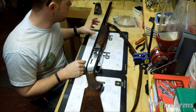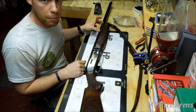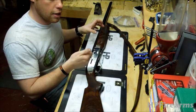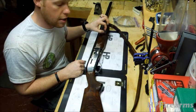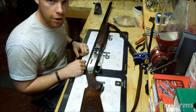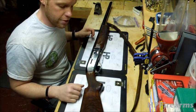Once you pull the recoil spring tube off, you will see there are two linkages — one back here you can barely see the tip of, and another short guide rod or link that connects to the seat for the bolt. What you're going to do is pull the whole bolt assembly backwards so that linkage comes back outside the frame, push the pin out to remove the linkage, then push the other linkage with the bolt carrier up and out. Then pull the bolt back again, lift the bolt carrier out of the gun, and push the actual bolt or firing pin carrier out of the front where the barrel comes in. Once you get there, you're pretty much completely disassembled.